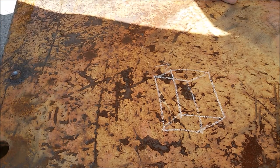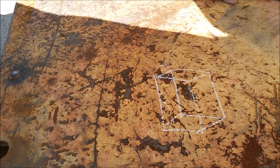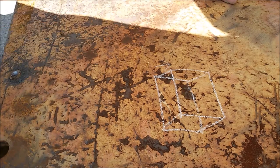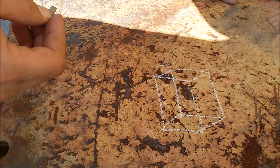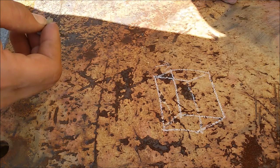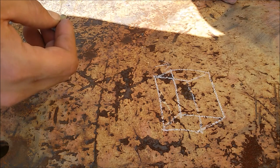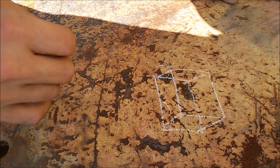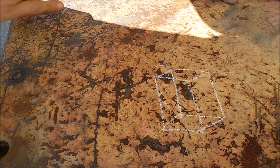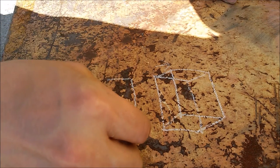So that means that the entire weight is going to be up here. All it's going to take is someone knocking into this, and it's going to go over because there's going to be very little support other than the smokestack itself. And the smokestack is just interlocking sleeves, and it's not going to really support it. And the last thing that you want to do is dump the whole heater, you know, one of these space heater Arctic, into a tent full of burning diesel, or vice versa. So the best thing would be to do one upper box.